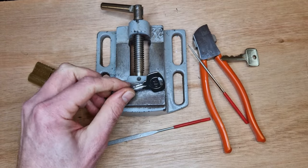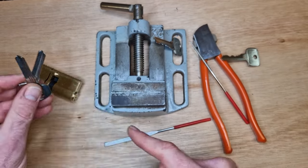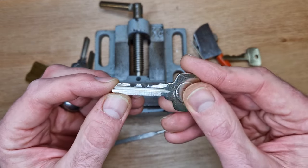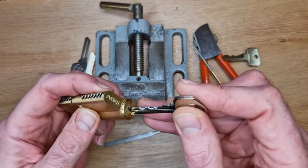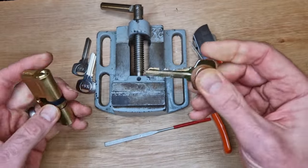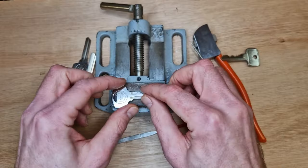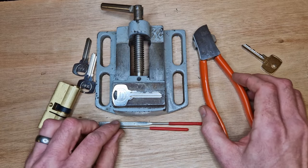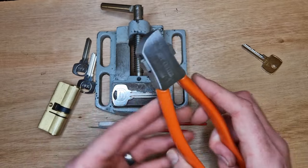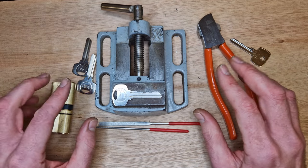I think I need to practice this a bit more - it's pretty new to me, but luckily I've got a load of blanks. I'm going to practice and see if I can get cleaner results. I think all that's down to is not looking at it properly while trying to film, and perhaps just a little extra filing would make it perfect. Either way, it's certainly going to serve a purpose for me - it's a really great tool to duplicate keys on the fly. All you need is this tool, a pair of mole grips, and a couple of files. Thanks for watching and I'll see you on the next one.